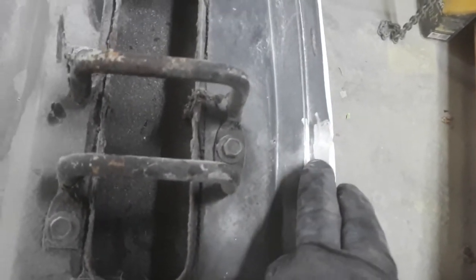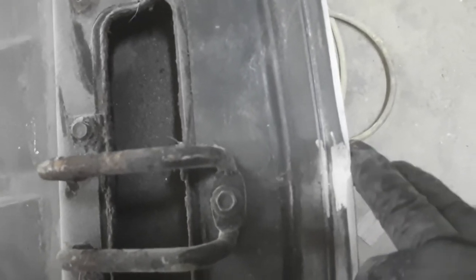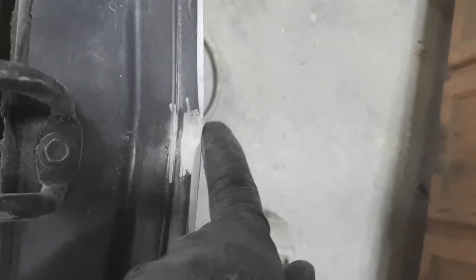There was another crack here right in the very front. I repaired the outside but the crack went all the way through. I took my die grinder — now that I have the front outside made up with fiberglass repaired halfway — I dug in the front half, filled it up with fiberglass mat and resin, then gouged out the back half of the crack into the good fiberglass. I've taken the whole crack out with the die grinder and now I'm going to use short strand automotive fiberglass filler, mixed with a bit of resin so it's a little thinner and gets totally into where it needs to go.